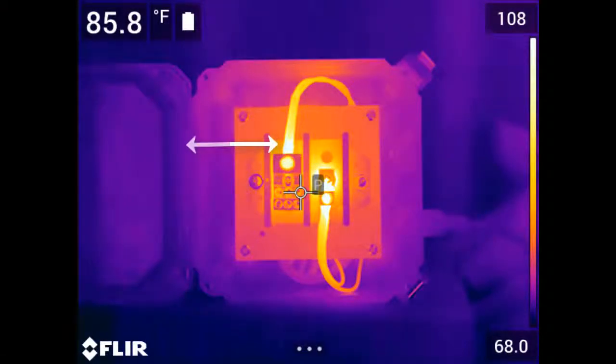For the autofocus to work properly, the target should have good thermal contrast, meaning there needs to be a distinct difference between warm and cool areas on the object. With targets that are more thermally uniform, where there's not much of an apparent temperature difference, it might be better to use the manual focus instead.